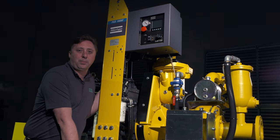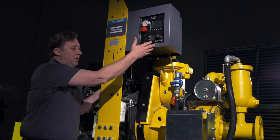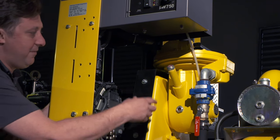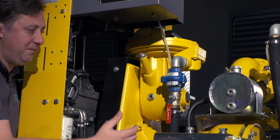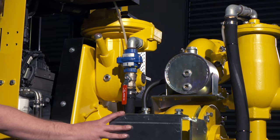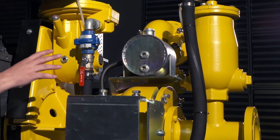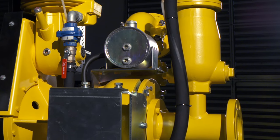The PAS portable pumps were designed for easy operation. By starting this pump, the belt will drive the vacuum pump. The vacuum pump will evacuate all of the air from the suction hose, drawing water to the eye of the impeller. The impeller will then force the water out through the check valve.